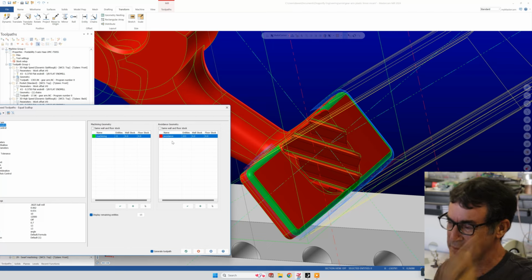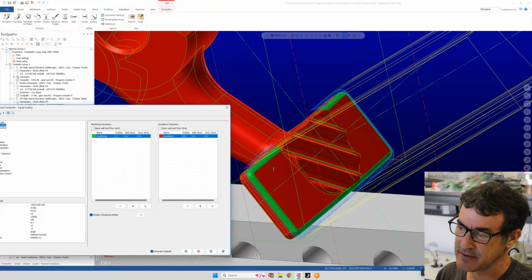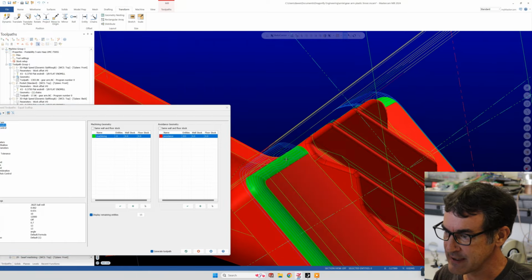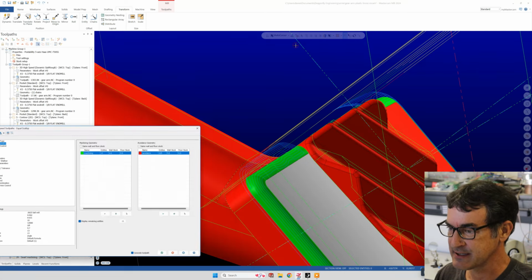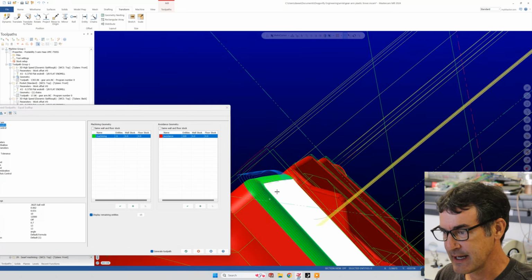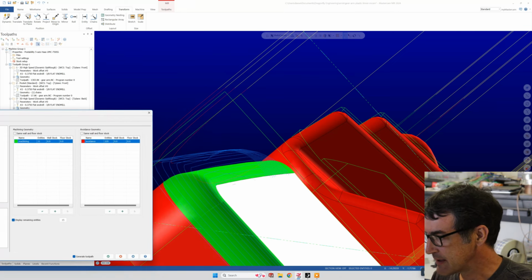And with Mastercam, I do have a pet peeve in that if you have a radius that you're 3D machining and you don't have the tangent face of that radius marked as avoidance, then Mastercam will actually try to roll its 3D rounding operation around and down into this face. In fact, maybe we can just show that. So if I unselect this face and I say in selection, and then we tell it to update, you're going to see how the toolpath is wanting to dump down into the 3D part. Let's see if I can.